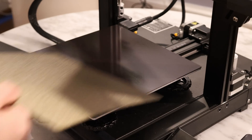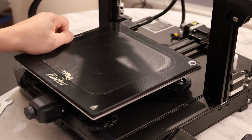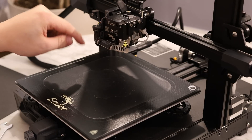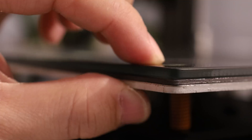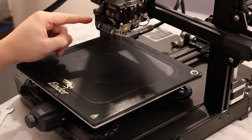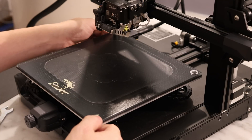Even if you wanted to use a glass build plate, you could just throw it on here and hold it with some clips. Since you have automatic bed leveling, it'll adjust to the new print surface. You can see this bed isn't super flat — if I push on the opposite corner, it lifts up about two millimeters. But since we have a CR-Touch, we can do mesh bed leveling, and even if the surface isn't perfectly flat, we'll still get a perfect first layer.